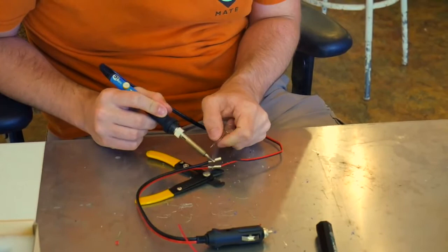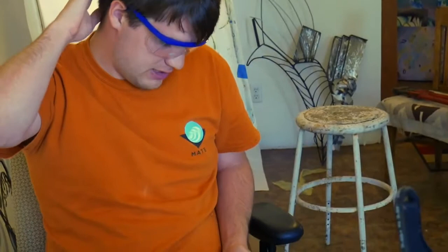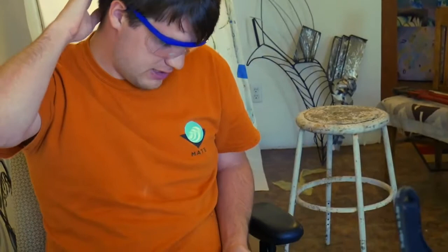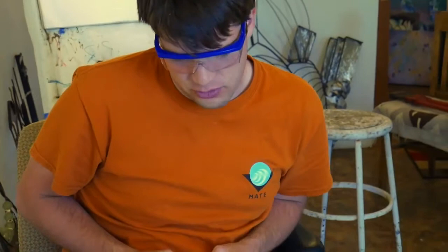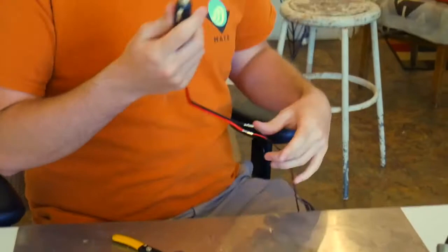I'm soldering pretty close to where I'm actually working — most people have the solder dangling around. The benefit of holding it this close is I can put it exactly where I want. On the other hand, if you're a bit careless with your soldering iron you're going to stab yourself with a 400-degree piece of metal, and that's going to hurt. I've been soldering for four years, so I can handle it — but if you're just getting started, keep it a bit further back just in case.